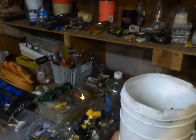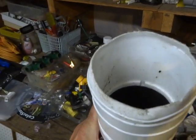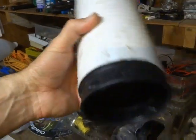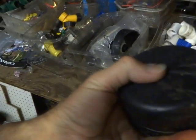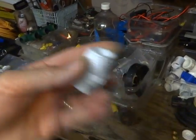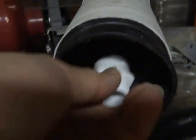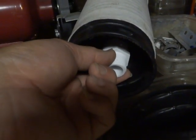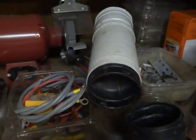The downspout drips and fills the top of the pipe, and it's capped at the bottom. The first ones I bought were lighter gauge PVC ABS, but now I have heavier ABS plastic. You drill a hole through it and glue fittings that fit a 5/8-inch hose end. That sticks out the bottom of the pipe, this fills up with water, and there's enough pressure to fill my big tanks or rain barrels in the yard.